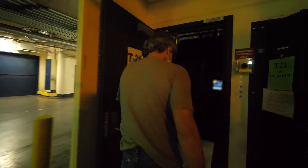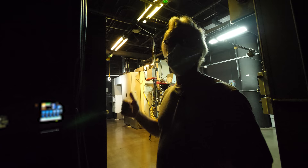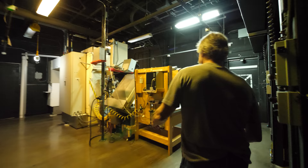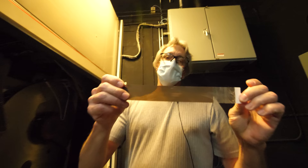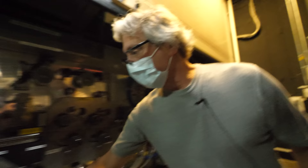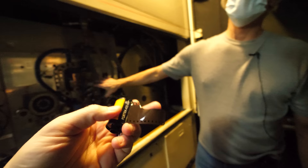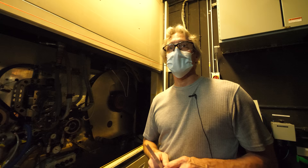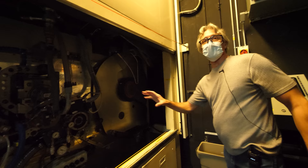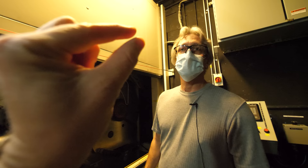This room has lights on right now, but it's usually dark — they work in a dark environment. This is basically the brains of the operation, on curtains so you can see the screen with no light damaging the film. So what are we trying to do in this room? The film comes in as just one piece. What we want is a finished product with the perforation. This machine right here — this is the heart. This is where the sprocket grabs the film and drives it through the camera. This is where we put the holes in and finish the product based on the customer's demand — what size they want, what particular code. You can do different hole sizes with different punches.